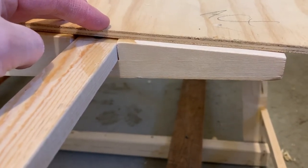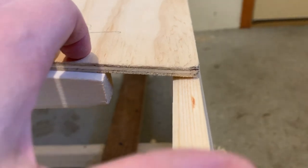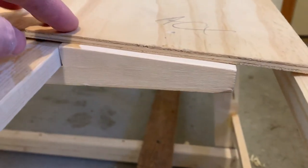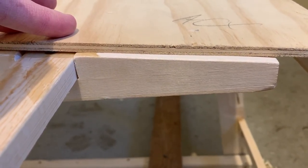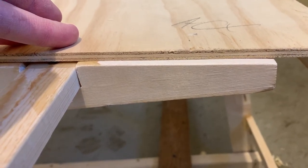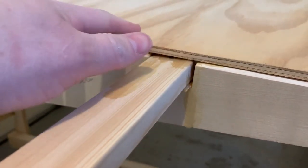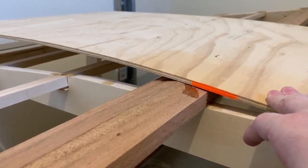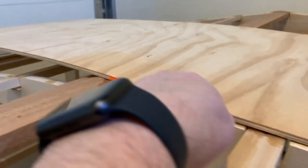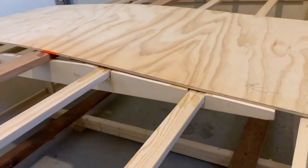I've run the planer from front to back. You can see the scraps all right everywhere — these are going to take some sanding. I'm not going to worry about planing these. I've got the angle pretty good right here on the chine, but this has got to come down about a sixteenth of an inch. I'm going to have to get the sander out for this. That's pretty close but still has to come down a little bit. The center of the hog has got to come down a little bit as well.